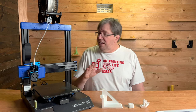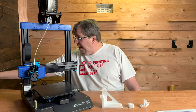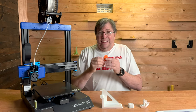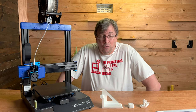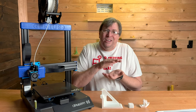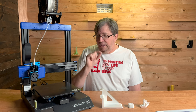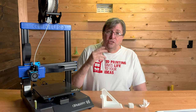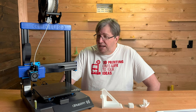I have printed PLA and PETG on this printer. I need to dial in my PETG a bit — I had a print come loose and the filament crept in behind the silicone head protector, making quite a mess. I haven't tried PETG again yet, but I plan to, getting the nozzle a little bit closer to the bed. There is Z adjustment available while printing — you can bring your Z down in 0.025mm increments to get closer to the build plate, making micro-adjustments as the first layer goes down, which is a really nice feature.